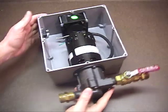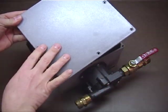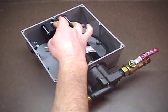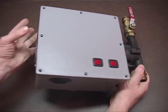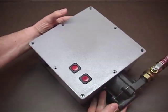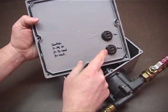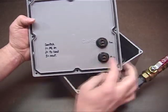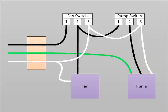Here's what it looks like with all the holes drilled. Some ventilation holes in the bottom as well, favoring the motor side. The last holes are for the switches, installed right here on the cover. When you do your switches, make sure you leave some space underneath — don't put them right over the motor or over the fan. Here's a nice area where the switches will go and won't interfere with anything inside. Here's the final product with the exception of the interior wiring. The two switches are mounted on the lid, and on the inside I wrote a legend for each of the three terminals on each switch: one is AC in, two is to the load, and three is neutral. I also labeled which switch is which on the back. Now I'll begin the wiring — here's an illustration of the wiring for lighted switches.